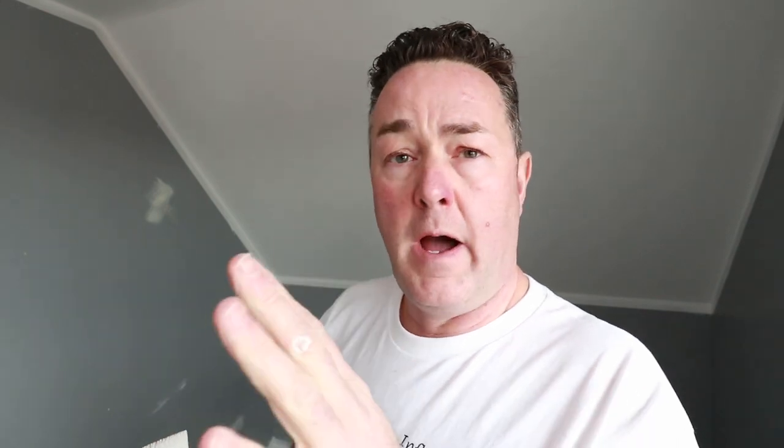I'm about ready to go - mixed up that colour, it's quite a nice colour. It's got a bit of a greeny tinge to it - it's light, which is what I wanted. I didn't want anything too heavy and dark in this room. I've just spot-primed - brushed onto the vinyl silk anywhere I've got any filler - so spot prime those bits of filler before you start putting your top coats on. Also this morning I wasn't happy with the ceiling because the Anti-Reflex 2 was thin from spraying, so the ceiling has had another coat this morning.